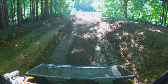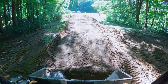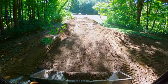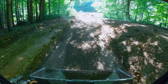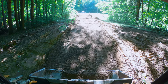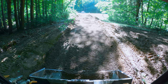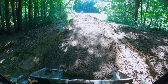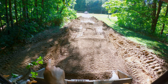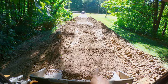Look at the finish we get — it's filling in all our little holes because our cutting edge has a little bit of material trapped under it. One more pass to even it out, and that is a nice flat, perfect grade. Now the advantage when you're doing a driveway like this — grading forward — is I can see exactly the thickness of the material I'm putting down. Driving up to the edge, you can see we're starting to run out of material over here.